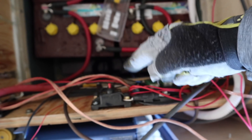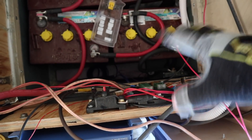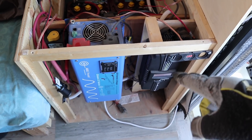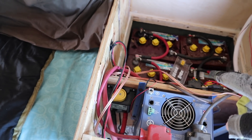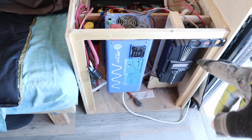I have switches, I have my bus bars, I have my fuse box here. It's just a real mess. On this side I have the inverter, the solar charge controller, and then I have an ACR automatic charge relay which allows me to charge the batteries here from my alternator if I need to do that. So that's the setup I have right now.